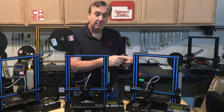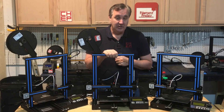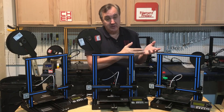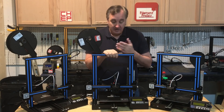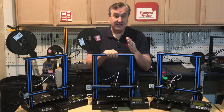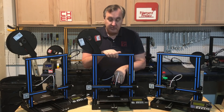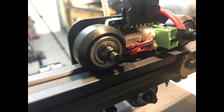Their machines seem to be getting better, and I witness it in this next generation. They basically made improvements based on what they heard from the community. First off, they improved that cable — it's now a pure ribbon cable, a real good flexible strong ribbon cable with IDC connectors that lock down, so it's much much stronger. They also went to two bearings on the wheels. Good move.